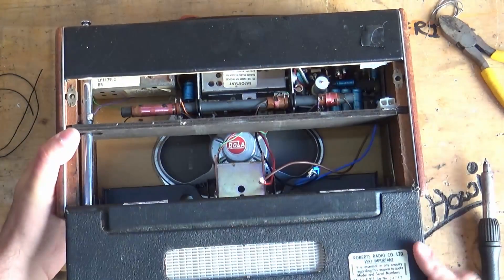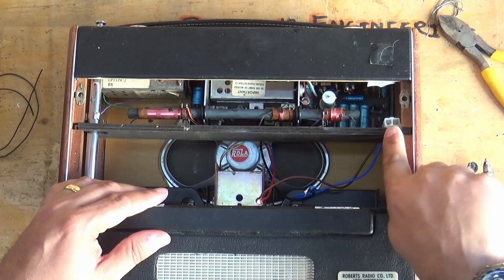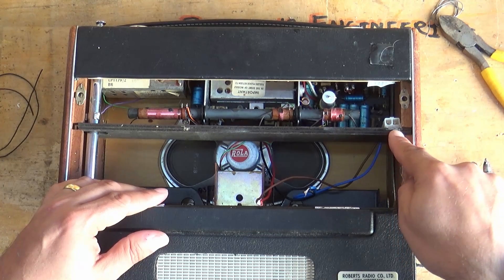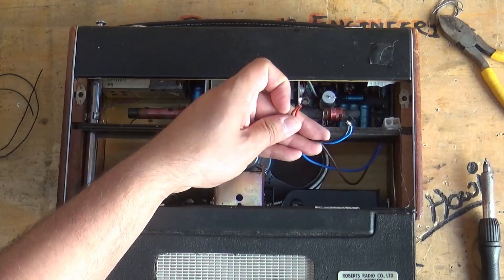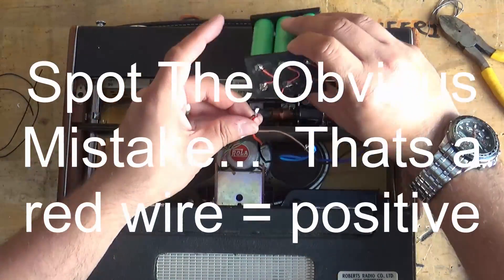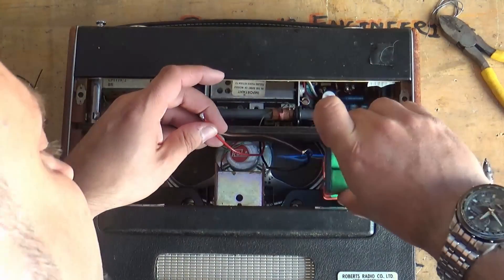Okay, so here's the RC connector — the 12 volt connector. It's got positive and negative pins clearly identified by their shape: this one is a semi-circle and this is a complete square. Two cables, one positive, one negative, going to the charge circuit and also going to drive the radio. Let's get the negative on this terminal here.